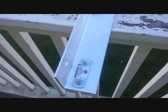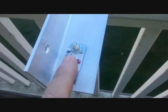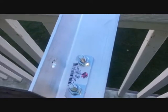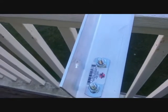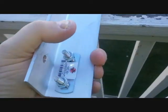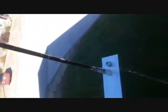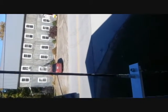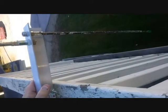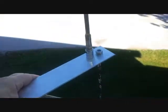I made a faux pas — the antenna mount I have in the backyard is one and a half inches in diameter; this fits over one inch pipe. I couldn't remember why I bought the same clamp as before, because the other portable mount takes one inch diameter tubing. So I can't show it mounted, but basically here it is — it's going to mount over the tube mast, and the dipole mounts like this in free space, about the same distance away from a tripod mast mount.